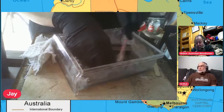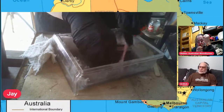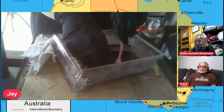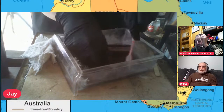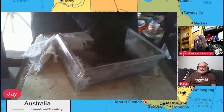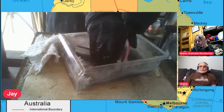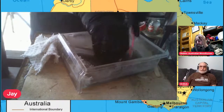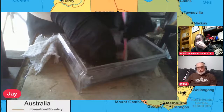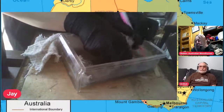You know, what I found really is handy, and you guys probably get them easier or cheaper, is to get, and I forget what size, but a shotgun cleaning brush. Oh, yeah, like a bottle brush. Well, it's a brass type brush, so it won't hurt the threads, and you can screw it in and out because it's just a little bit bigger, but it's still a brush and it gets the threads really well. And I got tired of screwing it in and out, so I'm lazy. I put it in my electric drill. It goes in, it reverses it, and it comes out, in and out, to get all the stuff that is stuck in the thread itself. Right.